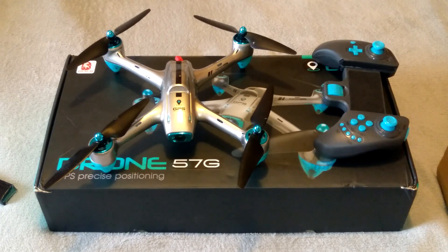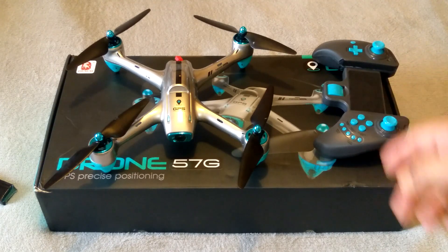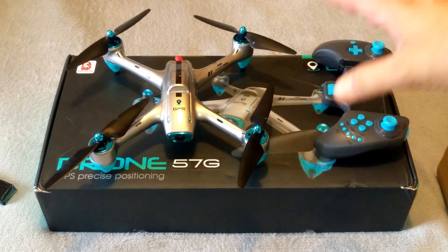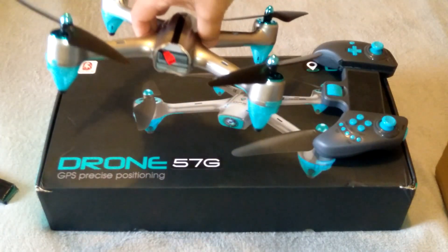It had a really good flight time, which is why I'm making this video. The reason I say 'had' is because the battery on this one — it came with one 1000 milliamp hour 2S lipo — and in my initial review it got around 18 to 18 and a half minutes of flight time, which was pretty impressive from a little 1000mAh pack. But when I went to charge up the 2S lipo a few months before Christmas, it had one completely dead cell out of the two, so it was totally buggered — it didn't charge at all.